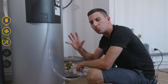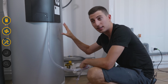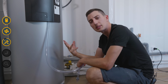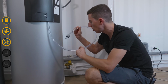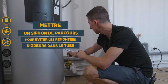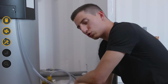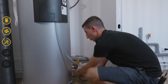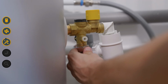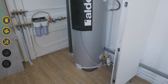Last drain left. Here, it's only a few drops, not liters, because the heat pump inside the water heater creates condensation. So we need to get rid of those few little droplets. There you go. With this transparent hose that I just connected after my siphon, it's almost done. But there's still one very important thing left. Actually, this is my cold water inlet hose that I'm about to screw under my safety group, and it's going to supply the water heater.